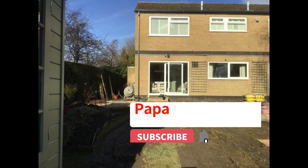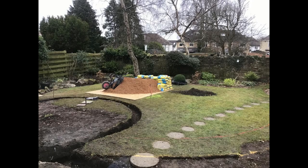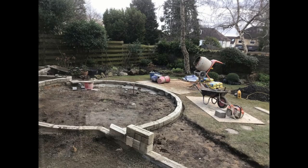You can see the walling going up to set the levels, and then it's basically backfilling all the walls. That one was taken from the bedroom window before the walls went up. That's the sand piled up to mix the concrete — we mixed all the concrete by hand, about one and a half to two cubic metres went into all the footings. And there's the footings backfilled and the walling up.